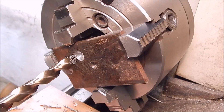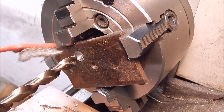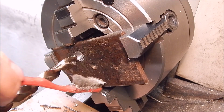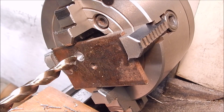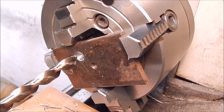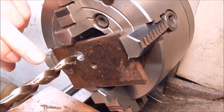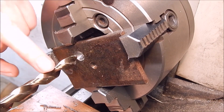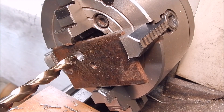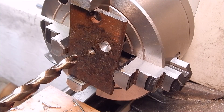You can see what it's like - it's not easy. There's a little bit of movement there from the uneven surface of the metal pushing it around - irregularities. Let's try drilling straight in with the 12mm jobber drill without a spot drill to see how much movement we get. I think you'll find that the spot drill makes a difference. You can see the difference - way worse. That's a good way to break your drills. So that's why you want to use spot drills.